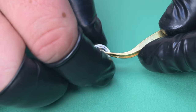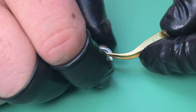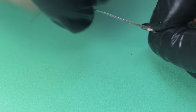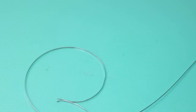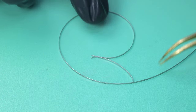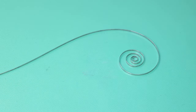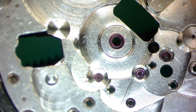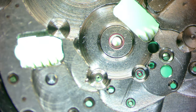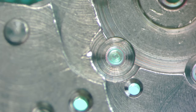Now removing the mainspring — I get my brass tweezers in there to make sure I'm not marring anything, unwind several coils, then get my fingers underneath and finish unwinding. Looking at this mainspring on the bench — it's pretty darn flat, not out of shape. One thing about Seiko mainsprings: the bridle — that tip on the left — is generally thicker than the mainspring itself. Replacement Swiss mainsprings will generally have bridles the same size. So I like to reuse the Seiko mainsprings when I can.